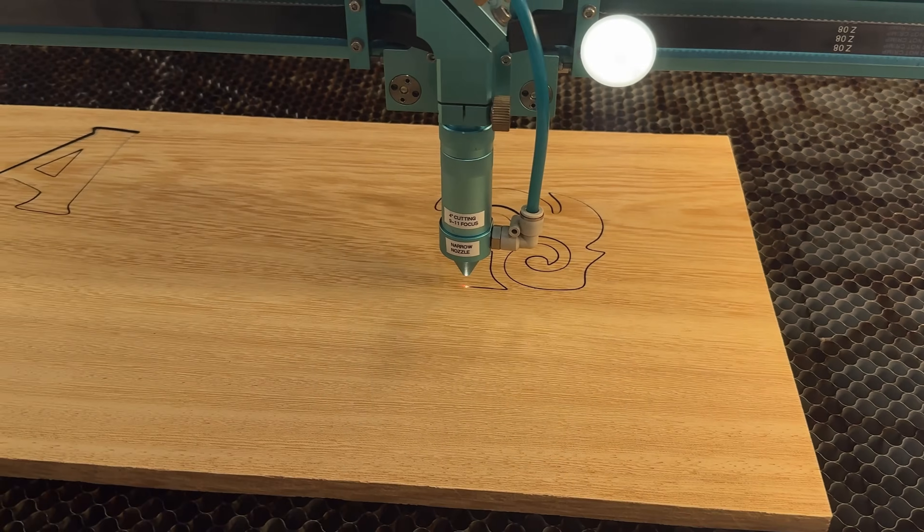With a 100-watt laser the spot size is bigger, so it's more powerful but you will lose a little detail compared to my 20-watt diode. This laser can still get the job done — I'm still able to do fine detailed patches and also cut thick acrylic and thick wood for signs. If you're doing something with very fine detail you may not want a laser this large, but if you do a little of both like me, I recommend it.